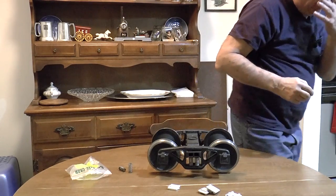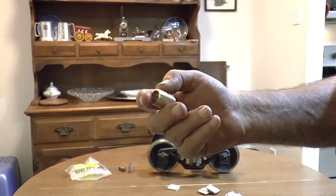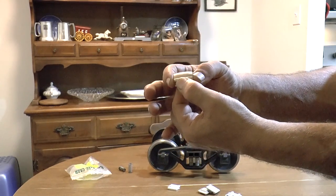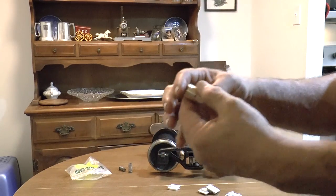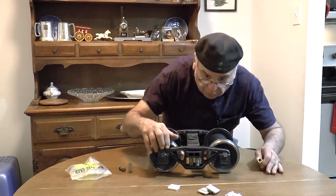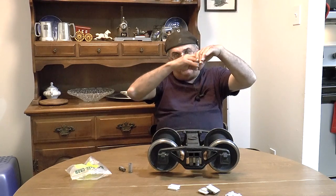This bearing - I'll bring it up close so you can see - is a bronze bearing that I make. It's got a hole that allows it to pivot all around - it's self-aligning. It's a half-inch ID, 0.500. I make the axles at 0.495, which is 5 under. So now it rides on the top side, and a little place for grease on the bottom picks it up and brings it up over the top. They work beautifully - I've never had a problem, 35 years or more of using them. It just makes it a lot simpler.